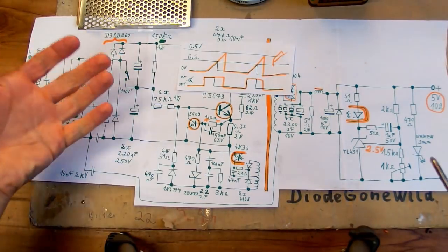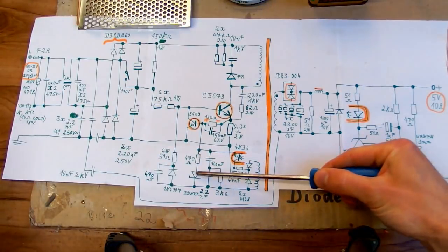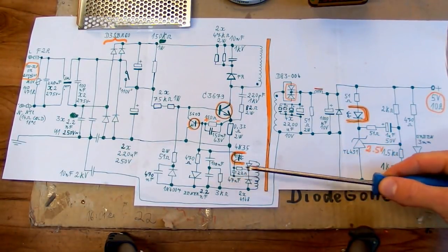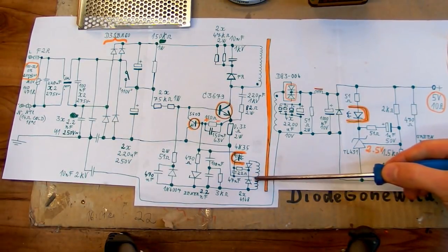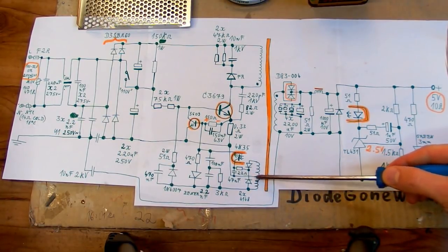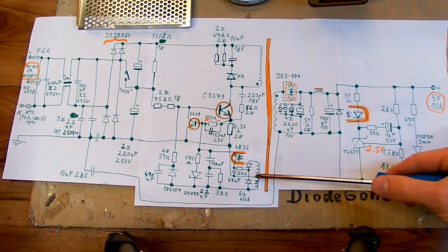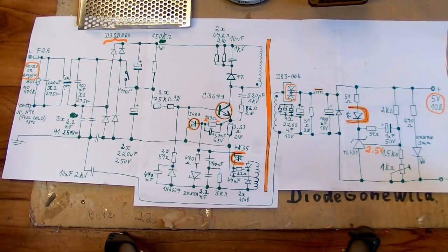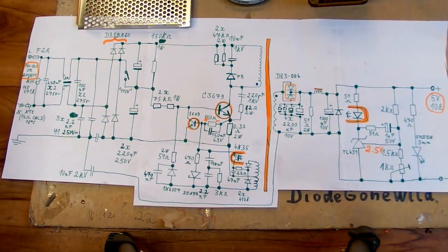And so this all makes sense to me so far, but there is this other circuitry with this resistor and zener, this capacitor, another capacitor and resistor, and this double auxiliary. I really don't understand why the double auxiliary is necessary. I think one would be enough to charge this capacitor for the optocoupler, but they have a double auxiliary and it's basically rectified in both half cycles, probably both forward and flyback half cycle.